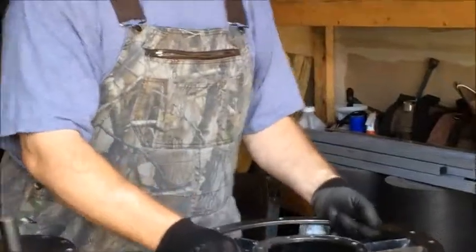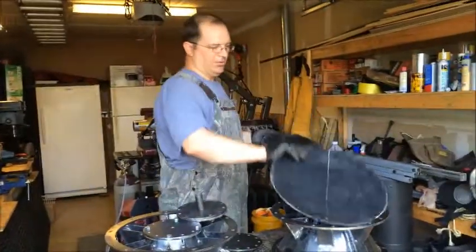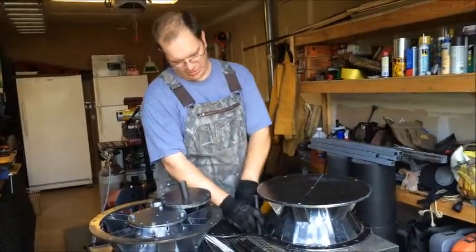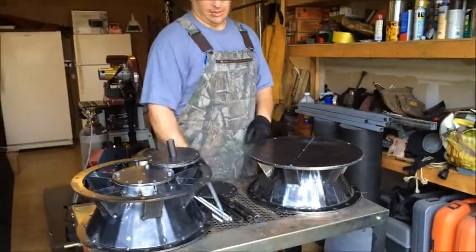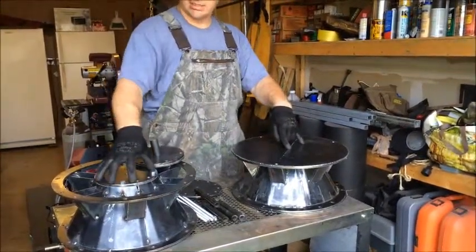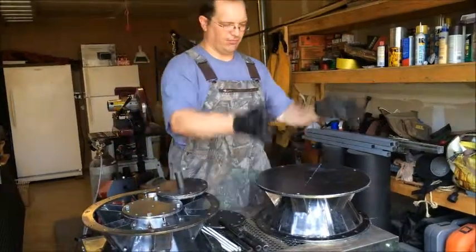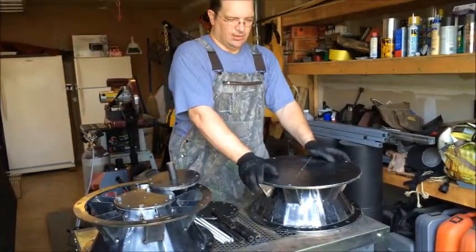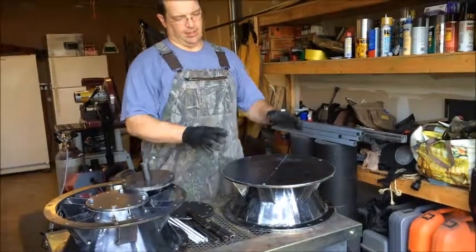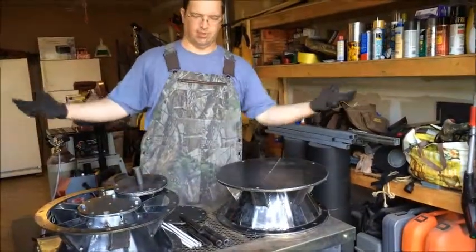So it was not symmetrical to lay out the jig. All I did was take the jig plates — one on top, one on bottom — and standoffs went in between these two rings, held in place with all-thread, nuts and bolts. There's a center portion to center everything up, because these plates were all bolted together, forming a nice solid group that's all lined up. Then I went in and tacked the cone in, and after the cone was tacked in, I started tacking in the arms. Once that was all said and done, pull it apart and voilà.